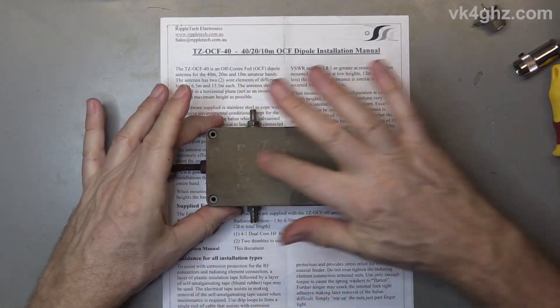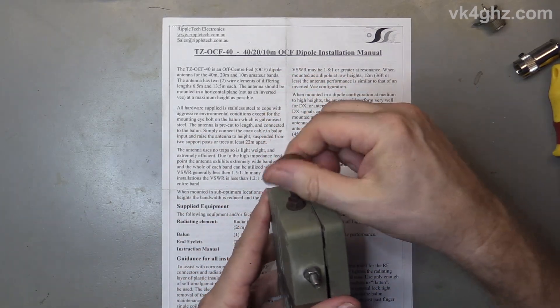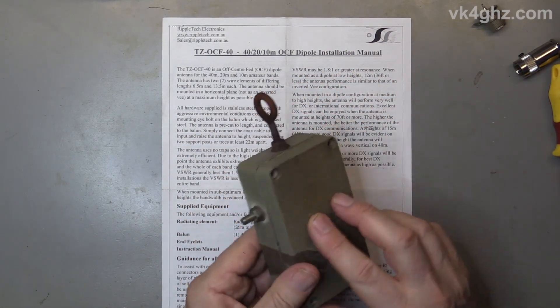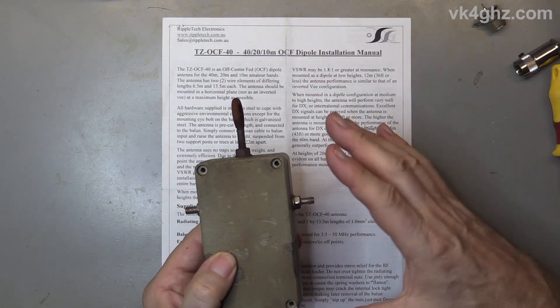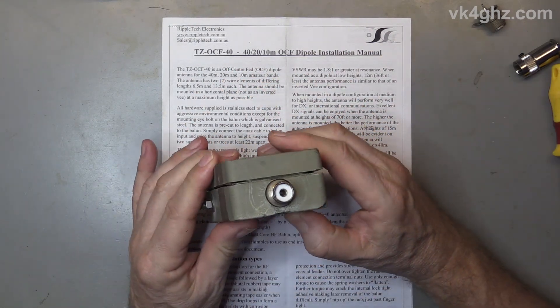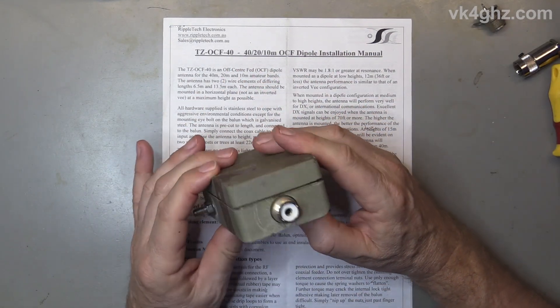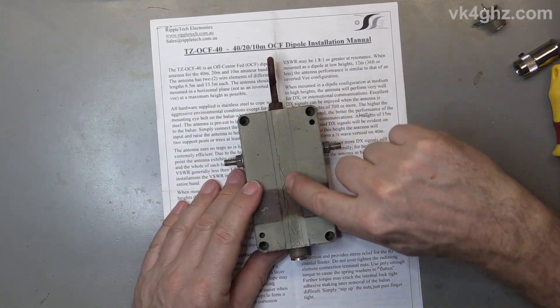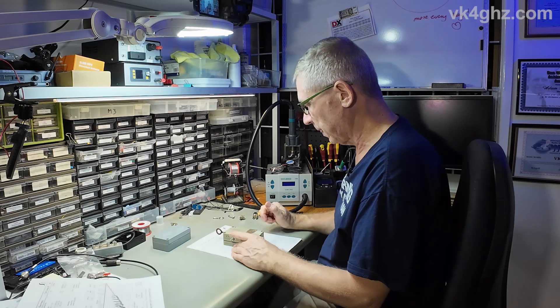The enclosure is a little bit weather-beaten, the non-stainless eyebolt is rusted — I won't be refitting that, I never used it. The stainless steel bolts on the side where the wires are hooked up are in good condition and the SO239 appears to be in good condition. On this side of the case there is a crack running along there, and I know exactly why that crack is there — it's the same reason it had an electrical fault.